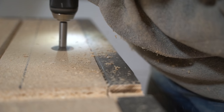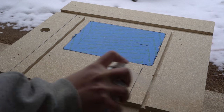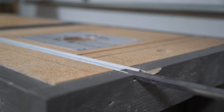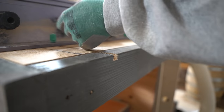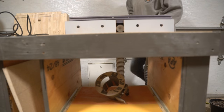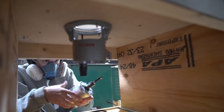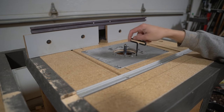To finish off the cuts for this surface, I used a forstner bit to cut a quick recess to make swapping the inserts a little easier. With all those cuts in, I gave the surface a quick high gloss coat just to seal it and maybe help relieve a small amount of friction. Once that dried I screwed in the miter gauge track, placed the fence and dust collection, anchored the router housing, set the bit height — and voila.